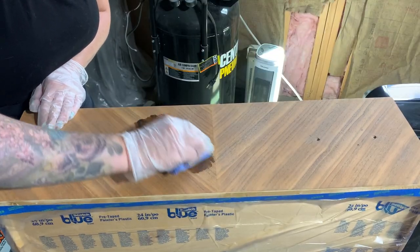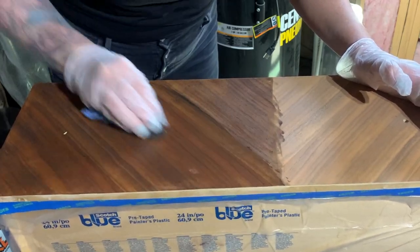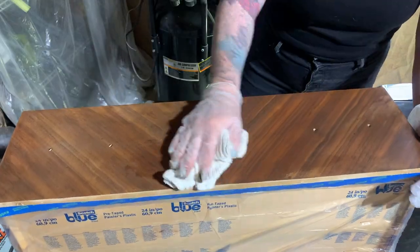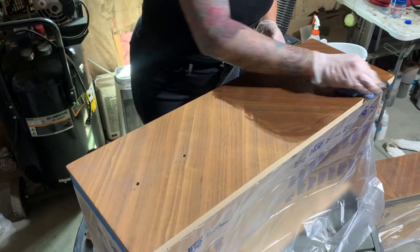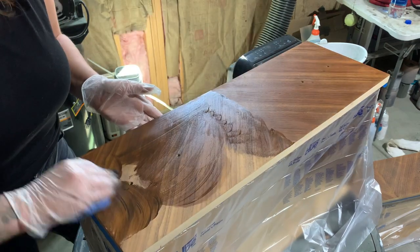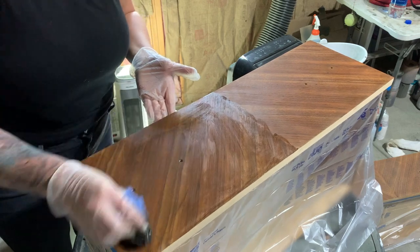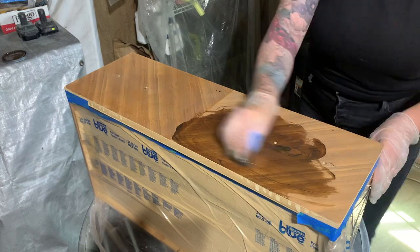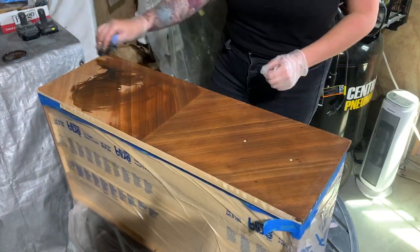Now that everything's clean, I'm going to apply a stain to all of the bottom drawers. I'm using Behr's water-based stain in the color dark walnut. I've been leaning a lot more towards water-based stains lately for two reasons: one, it makes it a lot easier to apply a water-based poly afterwards, and two, it doesn't stink. I've had clients tell me their pieces smelled in their house for up to a month, and I really want to avoid that — whether it means they feel like they can't use the piece or I have to hold it in my workshop for a month for the smell to dissipate. This alleviates that issue altogether.